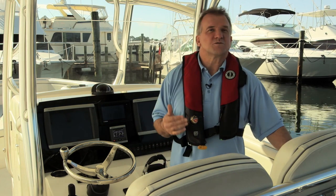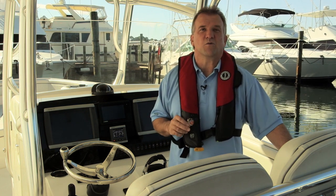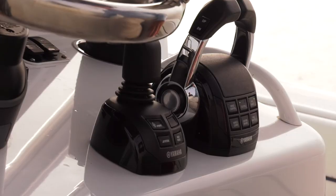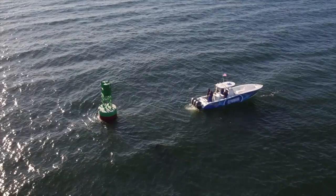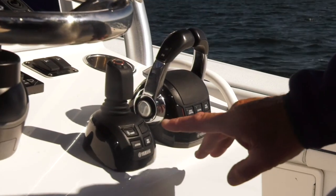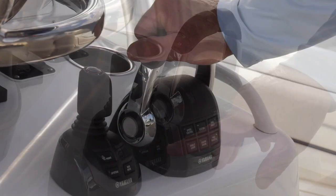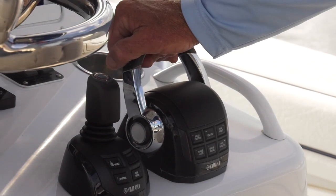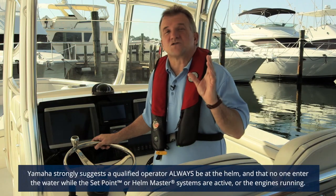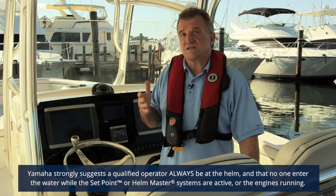Because Fishpoint uses such low RPM, your boat's response to movement is naturally slowed. If a bit of current, a wave, or a gust of wind grabs and turns your boat, just be patient — the system will detect that movement and begin working to return you to your set point using no more than low RPM. If needed, selecting high mode on your joystick will help bring your boat back around quicker. To disengage any of the Setpoint modes, simply press the Point button a second time. Or to disengage the joystick function altogether, either press the joystick button a second time or bump the throttle levers — even a little movement instantly turns off all joystick functions.